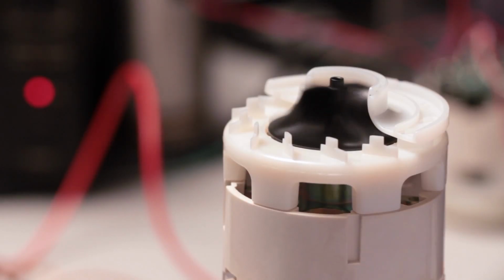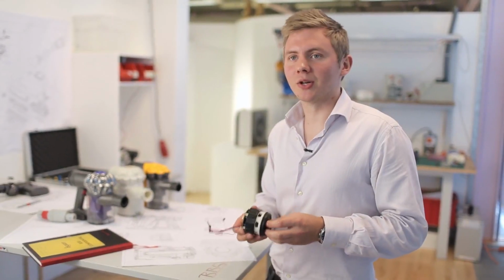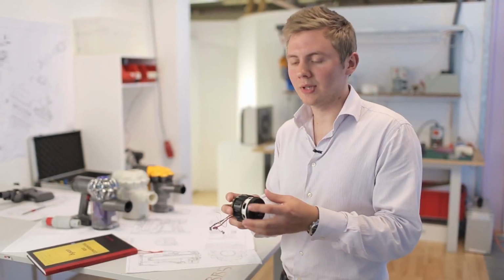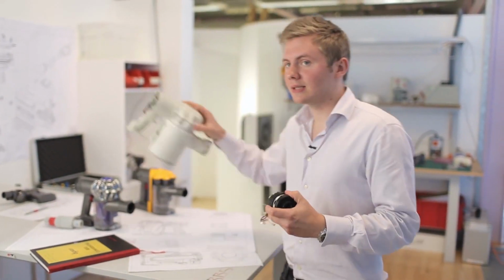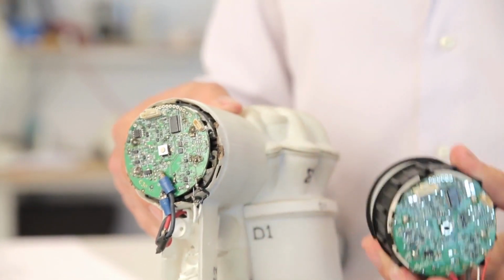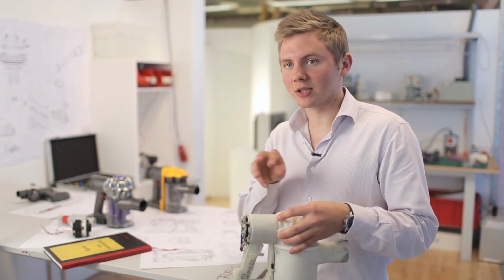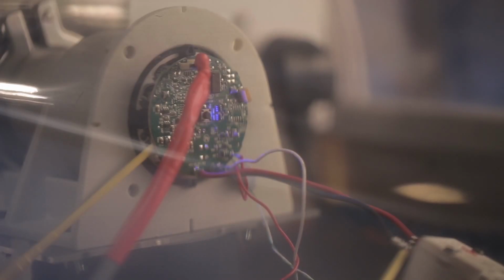And that's a far more powerful motor, providing a far greater through flow of air watts. We make this digital motor in-house because there isn't a motor on the market that can satisfy the specification and requirements that we need for our machine, but also because we need it to fit within a very specific housing. Our product has a 66mm inner diameter, and we have 6mm on diameter to play with to fit a radial seal. One of the techniques we used to get around this was to direct the airflow around the motor as well as through the centre of the motor to optimise how space was used within the motor bucket.